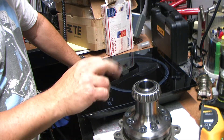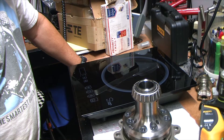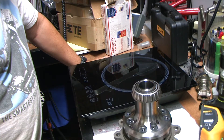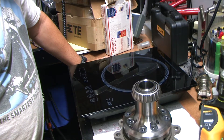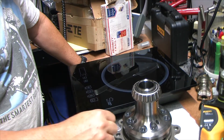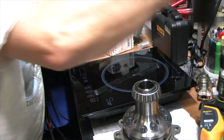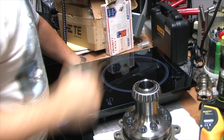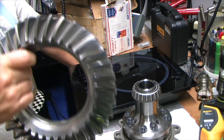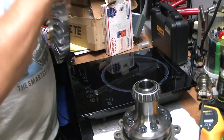After fooling around with the temperature to get it hot enough but not too hot, I don't think there's enough expansion to put the bearings on without still pressing them. For the bearings, I still needed the press. That's easy - I just used some scrap pipe I had and made a little adapter, which has always worked out well. Still need the press for bearings, but the ring gear is always a pain to get on even with the press.